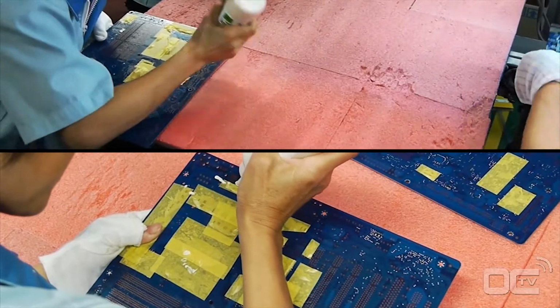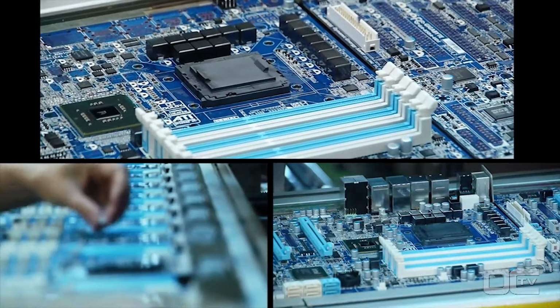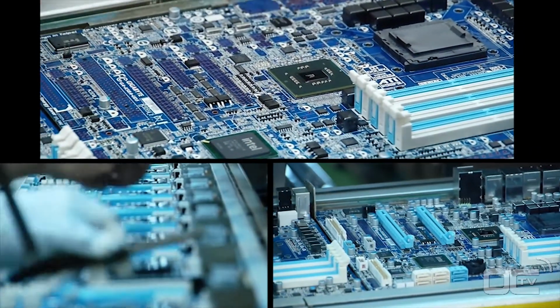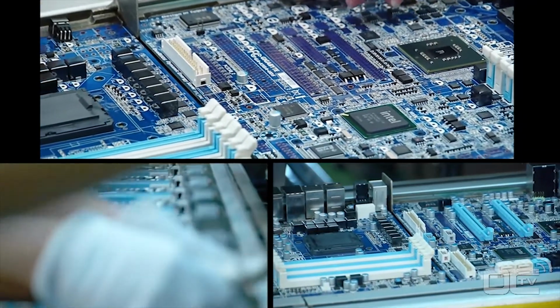The DIP stage is the second big important process when making a motherboard. First, you have manual insertion. All the small components and chipsets have already been added. Now it's time to place all the other components that have pins going through the PCB.